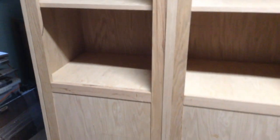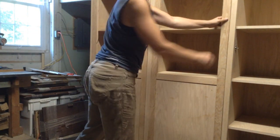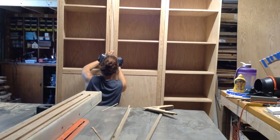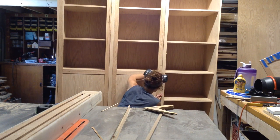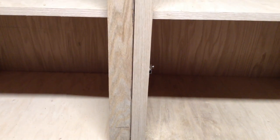That's what those three doors look like. The first one I've done the reveal on — you can see it opens nicely with a nice reveal going around the entire door. For the central one, to mark the reveal I'd normally use a scribe, but I can't find mine after the move. So I made a little spacer — a little more than a 16th of an inch, probably like 3/32nds — and being flexible I was able to line it up with the edge of the cabinet and draw the gap line on the door. It's not going to be the same all the way around because I have some low spots due to the plywood bowing, but I get a basic perimeter.